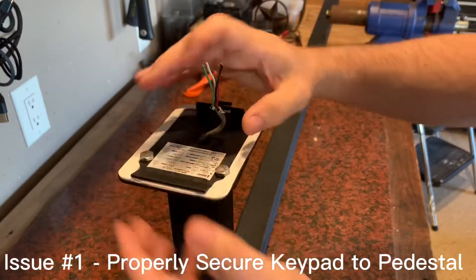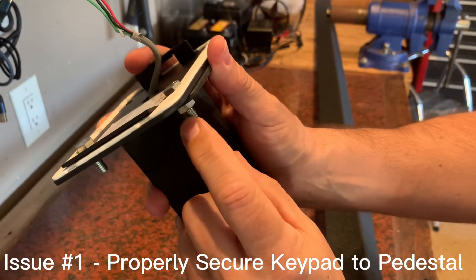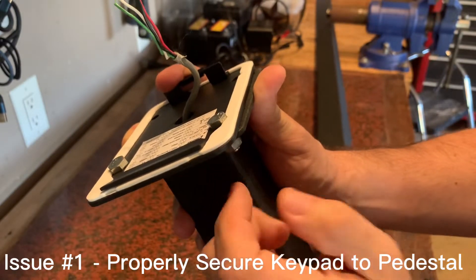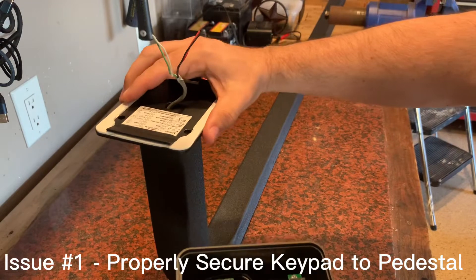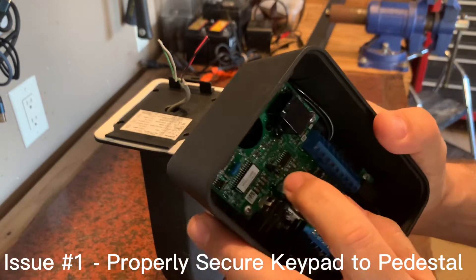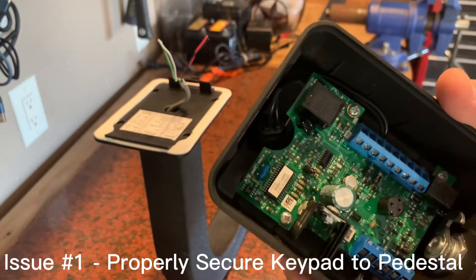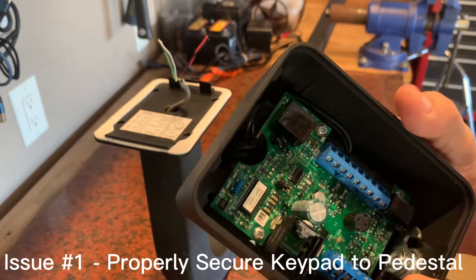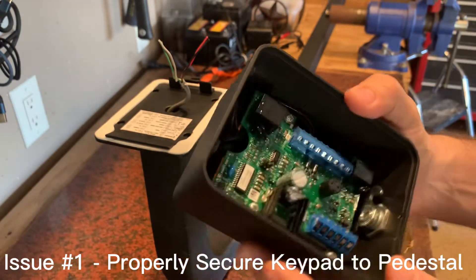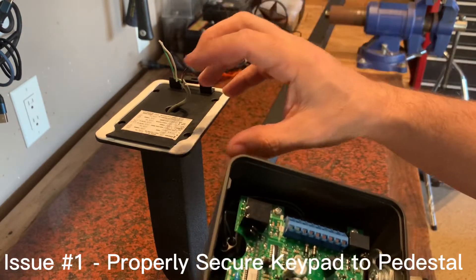I would suggest to go this route — attach that plate, and then when you're done, get your welder and weld these nuts to the bolt so that it is never coming off. They're going to have to take a grinder and cut it off, but they're not going to be able to just unthread this and get access. If you're able to unscrew this and get inside the linear, they could do something even more devious: removing jumper number two with power to the system. If you remove that jumper and replace it, you're going to reset the master password for the device, enabling them to add another code that you may never know has been added — now you've got a security breach through your gate. But if you weld those nuts, there will be obvious signs of tampering if somebody has to cut their way in.